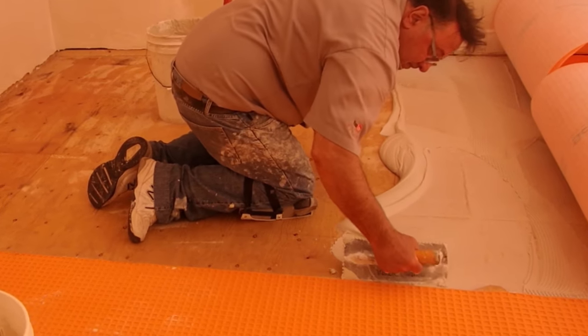Keying in your substrate really makes a difference. What keying is: you use the back side of the trowel — whether you're going over plywood, Kerdi board, Durock, cement board, or whatever flat surface — and you push the mortar into the substrate. This is really going to make a difference on bond strength. I'm going to do a little test and show you what the difference actually is when you key in the substrate before you spread and notch out the thinset.